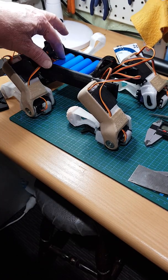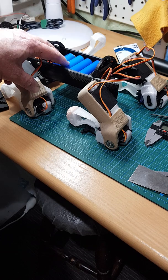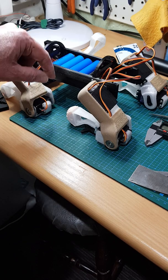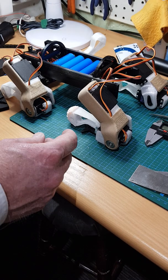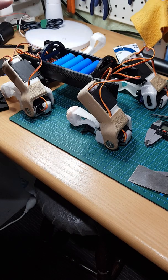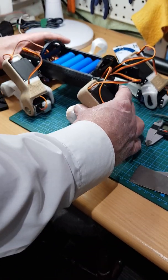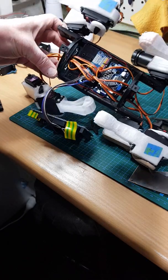I've incorporated space for four 18650 batteries at the top here. These are connected in two pairs of parallel, so the rated voltage output is 7.4V, but actually I'm getting over eight volts. You'll also notice the shorter legs — the legs are basically the only bit that remains from the original Spot Micro design. Turning it over, you can see the circuit boards incorporated into the underside.